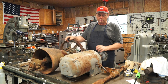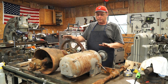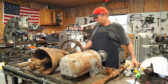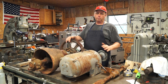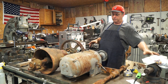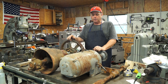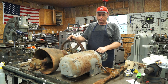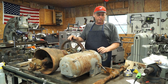So what we have here is the drop setup that was on the Pratt & Whitney when I purchased it. I've already taken it apart and started looking at how it was built. Basically it consisted of two rods that held the whole assembly up. We have a counter shaft and a Lehman electric motor with a four-speed transmission. The Lehman Drive is really nice — it's four speeds.